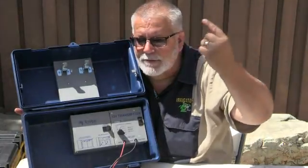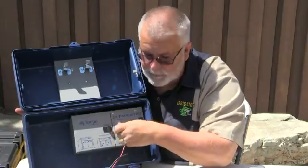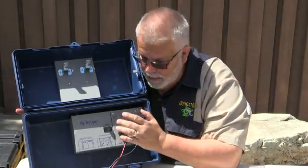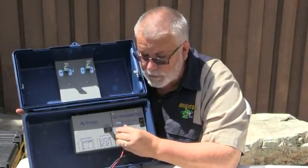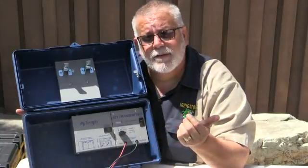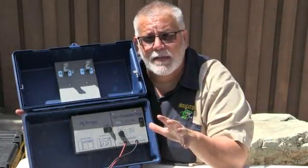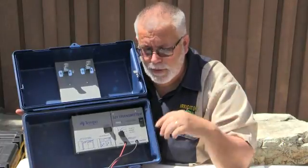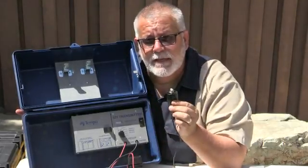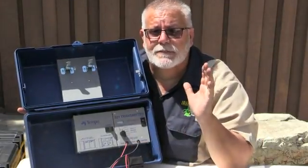Because it's hitting there and bouncing all the way back, I have to have the strongest signal to get it to bounce back. If I had it on three to get the same signal on a 1,000-foot run, the break is at the 500-foot range. On settings one or two, I'm within a hundred feet. On three, I'm at 500 feet. On five, I pick up my equipment from the clock, hook everything back up, go to the valve, cut the wires at the solenoid, put the red wire on it, stake in the ground, and I'm about 100 feet away from the break.